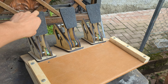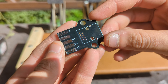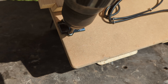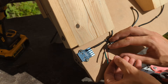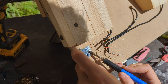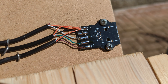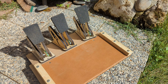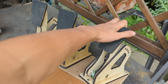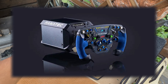We haven't finished yet because we need to sort the electrical connections. I just received the PCB from PCBWay so we can proceed by screwing it on the side of the simulator. After stripping the necessary wires, we can solder them to the PCB to get a clean and reliable connection. To link the pedals to the main board that will sit on the steering wheel, we will use an RJ45 connector, which will be soldered on the PCB - but unfortunately I haven't received it yet, so we'll have to wait and solder it in my next video where I will complete the simulator by building the force feedback steering wheel.